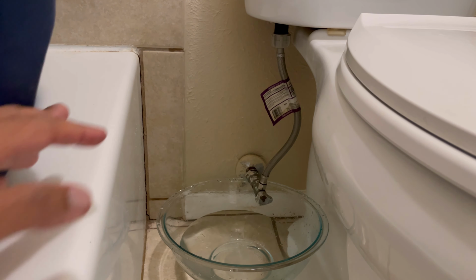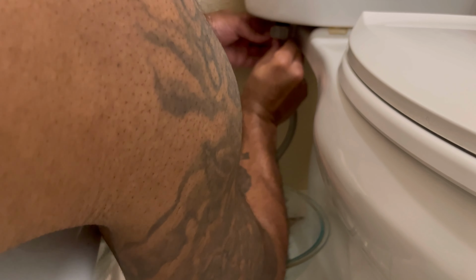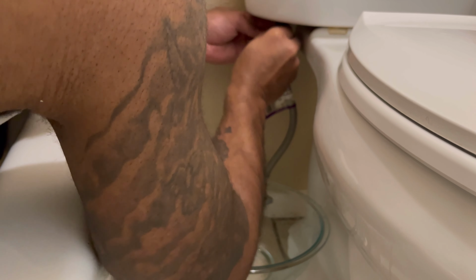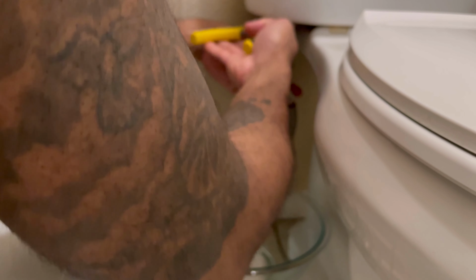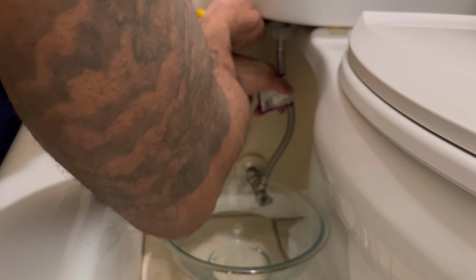And then once you do that, you can connect the hose to the bottom, the water valve to the bottom of your kit, so that it allows for that water to come through. With your hand, you can tighten it. I did grab my vice grips again because my hands were wet, and I just wanted to make sure that it just didn't have any air coming through. So that's all I was doing. You don't necessarily want it too tight, because in case you have to do some more work on it, you want to be able to get back in it without any real major issues.